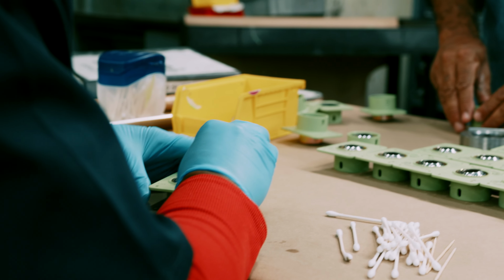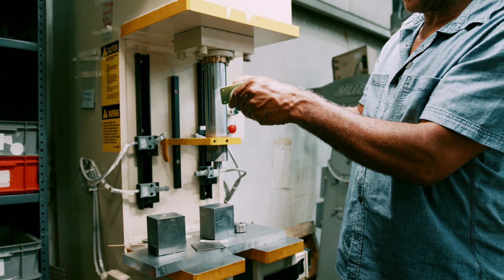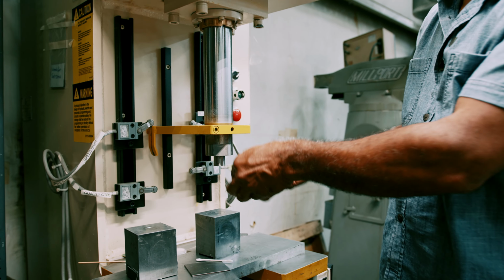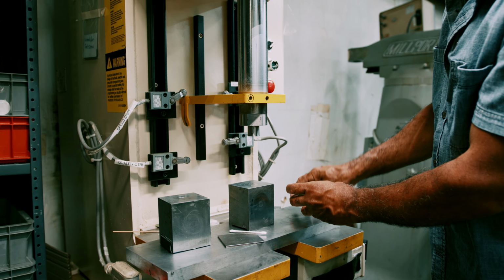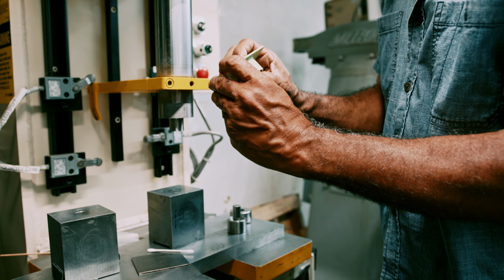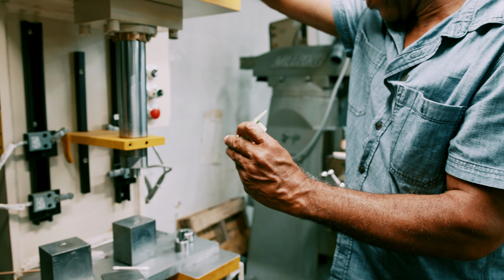The anvil we use for this particular part, you can see, one end goes in here and the other one goes like that. So you can either heat it like that, or like that, it doesn't matter. Press locks it in. Yeah. So what you want to do, though, is line it up first. You don't want to just have it flush right here. And the pressure is already set up for this one.